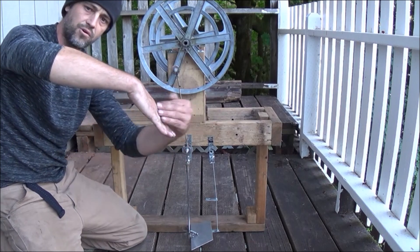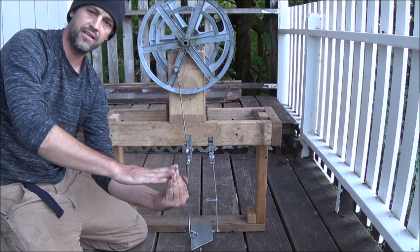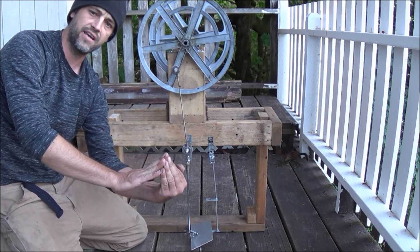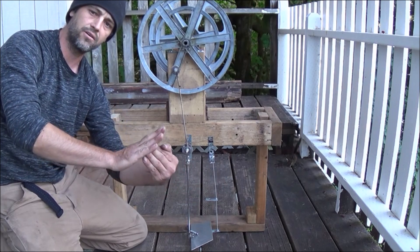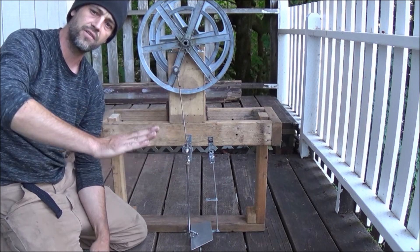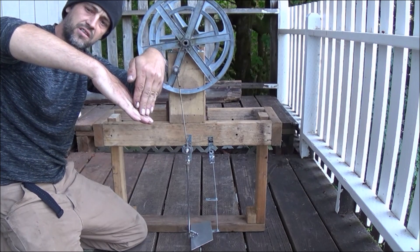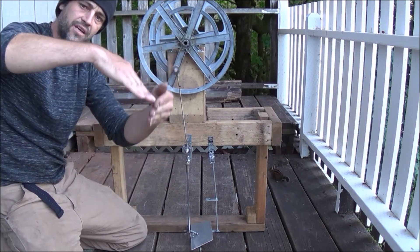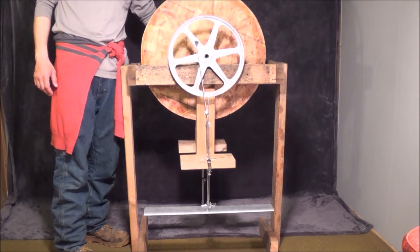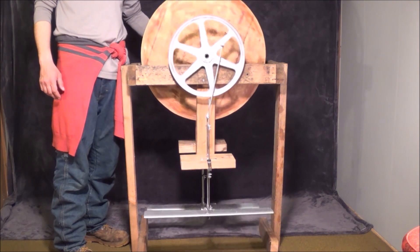So it's coming down, the force is hitting it, driving the rod down. As it comes to the bottom, it's going to hit against a little piece that changes the angle of the foil. Now the water hitting the new angle of the foil is going to drive a force against it — the deflection is going to make sure that rod goes up. Once again at the top, it's just going to hit against something that changes the angle of the foil, go down, and then back up again, over and over again. I'm going to actuate this real quickly for you so you can see the two different hydrofoils.